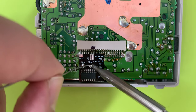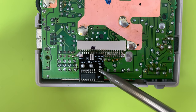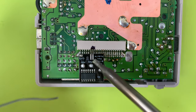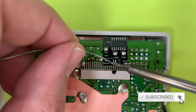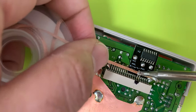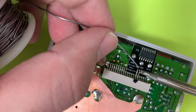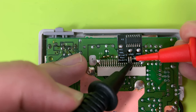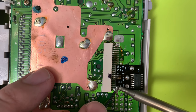These are pretty easy joints to solder — you're just going to want a ton just sinking down in that hole. Easy peasy. Make sure they're looking good. Now we're going to put some solder on the ground pad. Now we're going to solder the two pins from the motherboard to the bivert chip. Be careful not to put too much solder as it's going to short the two pins. If you do, it's not a big deal — just use some solder wick or some solder flux to redirect the solder to make them discontinuous. Check for continuity, making sure there's no continuity between both of the pins. Now let's solder the ground to the ground of the motherboard.